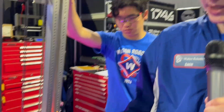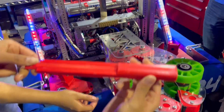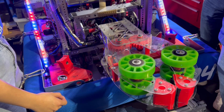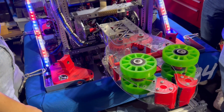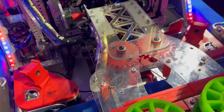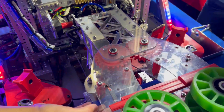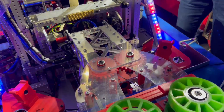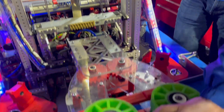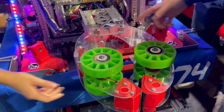We used two gears in the back so that in case one pneumatic piston was slow or one was fast, both arms move together. You can see it just opens and closes together because of the two gears. For reinforcement, we added two aluminum plates to the pneumatic piston so that if we get knocked or something happens, there's a much lower chance of breaking at the stress point.